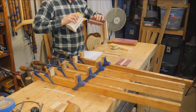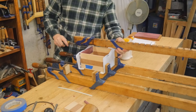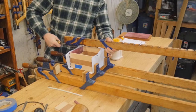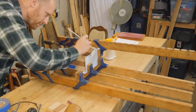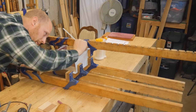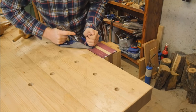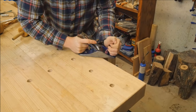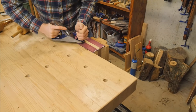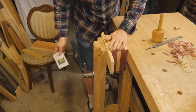Now to glue it all up — this is when you get to actually see how solid your dovetails are. I use paper on the edges to absorb the glue. I'm going to be planing all of the corners down, so I'm not worried about any glue spill-out there. On the inside, I just use a straw to remove any squeeze-out, any of the little drips on the inside — I can push it into the corner and remove all that. After it dries, I'll take the plane and give it a nice smooth surface. Bring all of the dovetail joints nice and flat so that you get that really nice look, then finish it off with a card scraper and give yourself that nice, pretty finish.